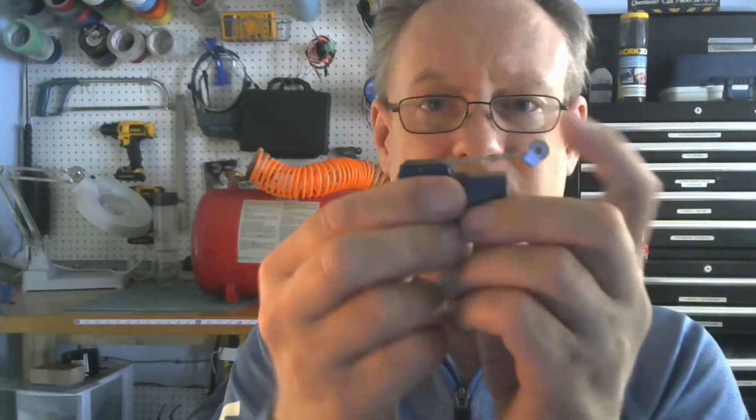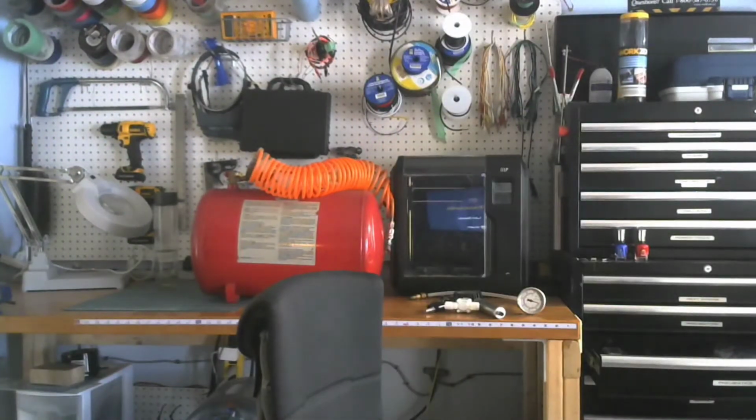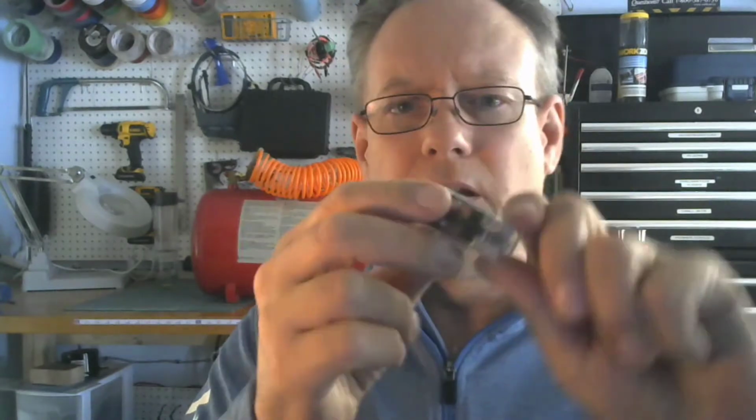Often we get the electrical impulses from limit switches. I can also get an electrical impulse from a relay. I could have this little relay here, part of maybe a logic circuit where a couple of relays are making some logical decisions. And then this relay finally says, okay, solenoid, go ahead and energize. That's a word we use for solenoids. And that solenoid obviously would be in some kind of valve because we're actually controlling air, right? Because we're studying pneumatics or electropneumatics.